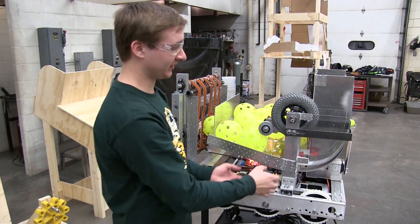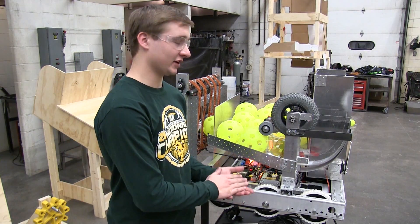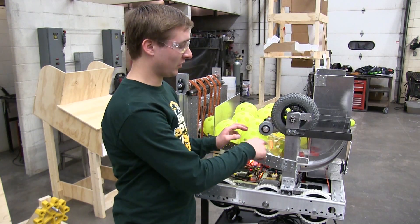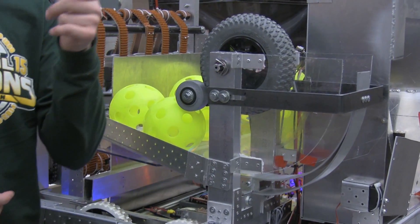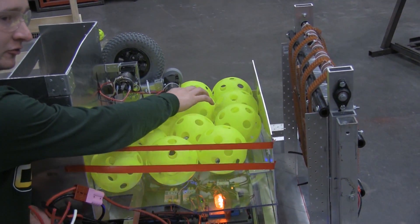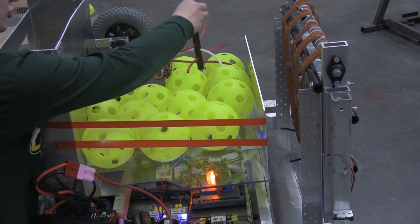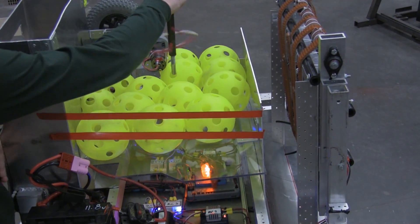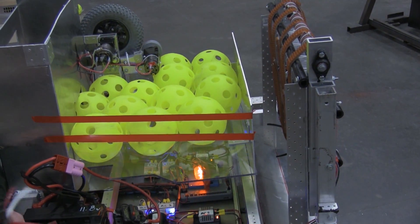A few problems: we didn't make this adjustable so dialing it in was a bit of a fiasco. Some options for metering would be either having a wheel like this feeding one ball at a time, or you can gravity feed it and have a little servo that would let the balls in. We're currently having problems with it clogging in front of the metering wheel. An idea to fix that is to use a tube with holes drilled through it and pneumatic tubing put through the holes — then it will spin, get rid of the clog, and hopefully also act as a sort of metering wheel in itself.